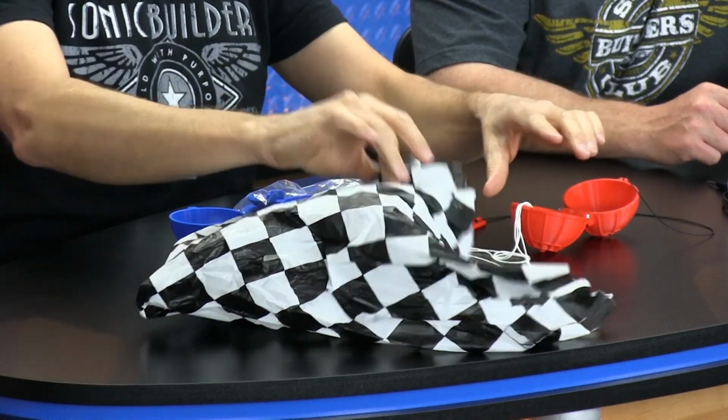The reason that this parachute is such a great combination with this project is when it opens, you do have some mass at the bottom, and the old round chutes tend to oscillate. And this chute design with the vented corners will dampen that every cycle. You can see it dampening until there's no more oscillation. The reason that's important is it gives you a longer descent time.